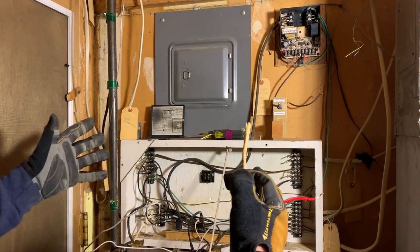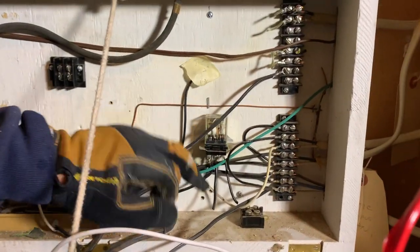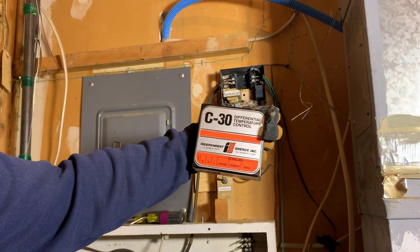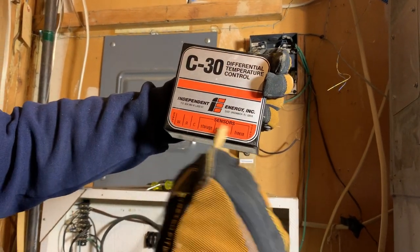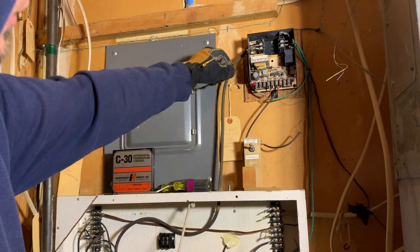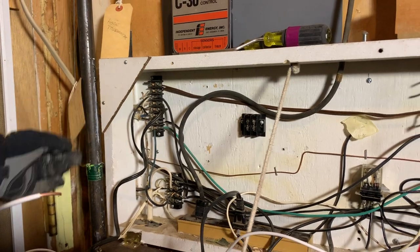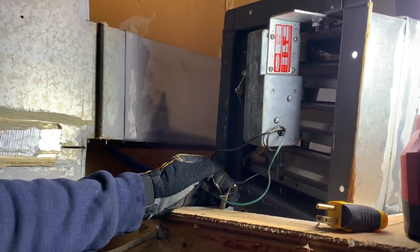This was his idea of a bunch of contactors, controllers, and ice cube relays with 110 volt. He had one little relay — a 110 ice cube relay — but it looked like it didn't work so he cut it off. I'm going wire to wire to cut things out. What I found is this little box up here was a different temperature control. A lot of his notes said 1981 — I was six years old playing G.I. Joes. Following the schematic, power comes in here to a control strip, these are switch legs out that go to the panels above for house thermostat at 110 volt and dormer power.